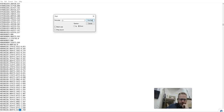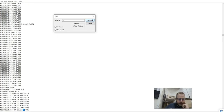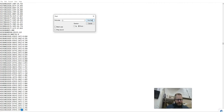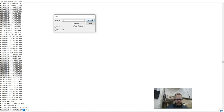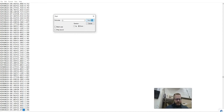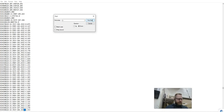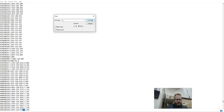You can even hit enter, and I'm just hitting enter quickly. Look at how many lines of code it takes just to cut that ramp to go into your project. I'm just holding enter down, getting through a few more ramps. Every time it starts a new cut, it's got to go through that. I'm just scanning this to make sure that none of those Z negatives are too deep, because that would be a problem for our CNC router. If X and Y are off, we can live with that because the CNC router will stop that. But just holding down enter here, just finding the next one, making sure.